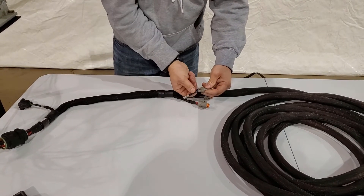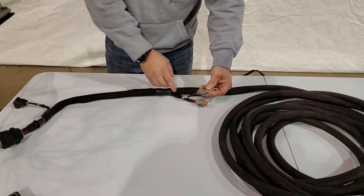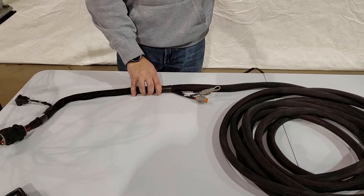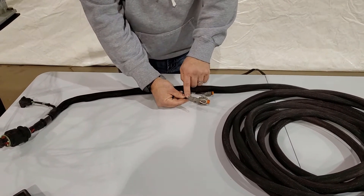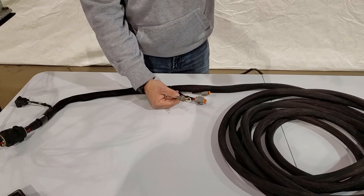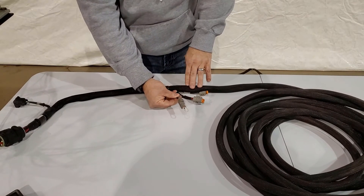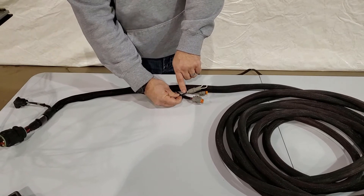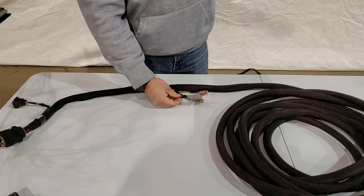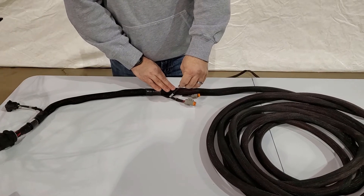If you lost transport mode with your two caps on, there could be a break in the wire between the two connection points. You'd use an ohmmeter to check between here and your connections at the front of the implement harness and at the rear to the other plug. If you can't find the break, you can run a wire from here all the way up to the other safety switch and bypass the wires in the harness to get your customer going.